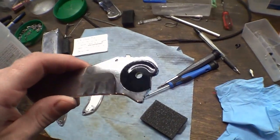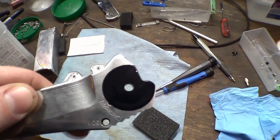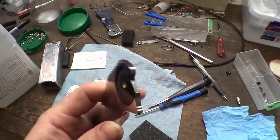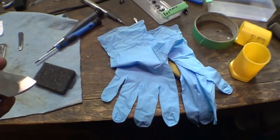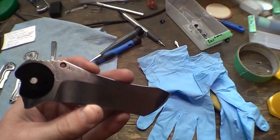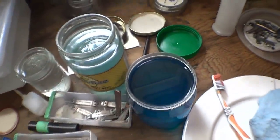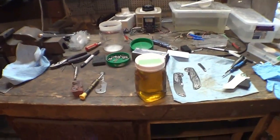I really clean in here with acetone using a Q-tip, and then I'll put down these stickers to protect the detent track and a few other things. As you can see, I've got the etching stickers on both sides — it covers the whole detent track area, and I just have to cut it a little bit and wrap it around the lock bar. So now I'm going to put on my proctology gloves and get to work, do another acetone wash. And then to get the acetone residue off, I'll dip it in some Windex, scrub it a little bit, and rinse it off.